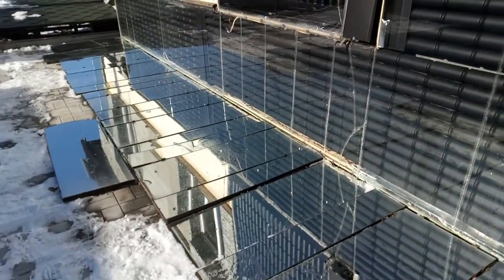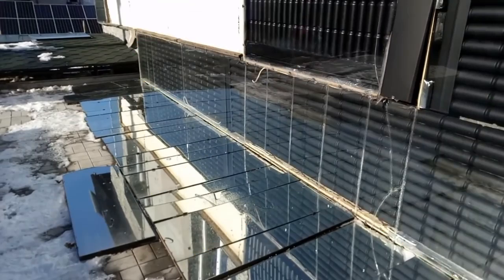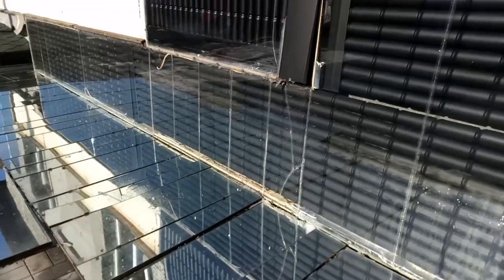If it is midday in December in Paris, the reflection from the mirrors will cover only part of the solar heaters, and this partial coverage radically reduces the mirror gain factor. The coverage at midday in December should be like this, and therefore the width of the mirrors should be about one and a half times larger. My calculations assumed that the width of the mirrors was three times greater than the height of the solar heaters, and such gaps between mirrors also reduce the mirror gain factor.